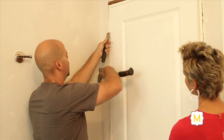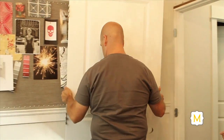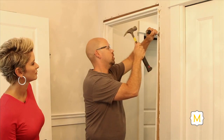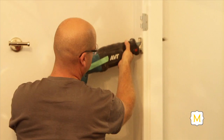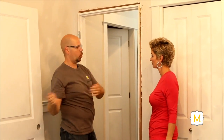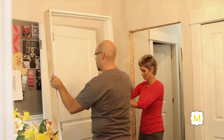Put it up under that lip and slowly hammer; once most of the way out, you can simply pull it. The slab can then be pulled out from the jamb and rested against the wall for future installation or demolition. Next, find what's securing the jamb to the framing. Use a pry bar to slowly pry the jamb away and find out what's securing it. If it's nails, shear them off using a dull chisel and hammer. If it's screws, use a reciprocating saw, cutting up and around until the jamb is clear and free. Then remove the door jamb completely out of the opening — you may want a friend to help if it's heavy, to avoid damage to the walls or yourself.